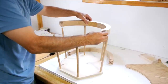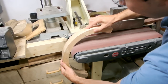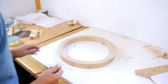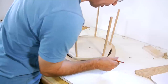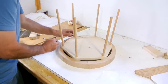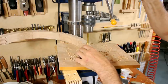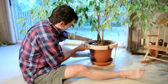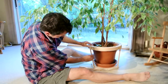Still waiting for that glue to be dry enough, but that's gonna go on here something like so. Now that the glue is finally dry enough, I sanded it and now I can put this together. I need to mark six spots where the dowels are gonna go, so I'm just gonna use my base and place it on here. I want to make sure the dowels don't end up on a joint. I'll get this centered and then just mark approximately where these need to go — if they're off by a few millimeters no one will know. I was a bit nervous once I'd assembled this ring that the pot wouldn't fit inside of it, so I brought it here to do one more fitting before I glue it. I actually have a bit of space inside and the dowel seems to be about the right length too, so I can go ahead and finish this up.